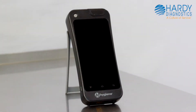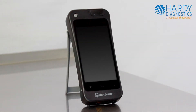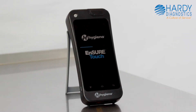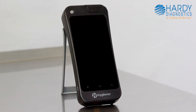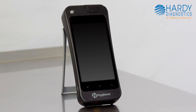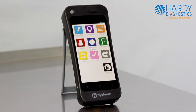Press and release the power button on the top left of the screen to power it on. If you see the screen illuminate, then the instrument is powering on. Be sure not to press the power button again after you see the screen illuminate or it'll turn off. If it doesn't power on, long hold the power button for 20 seconds or until you see the screen illuminate. The boot up screen will appear 4 seconds after that.